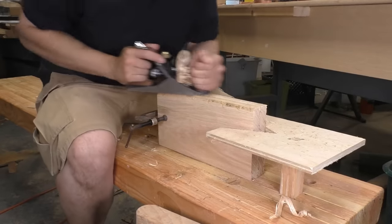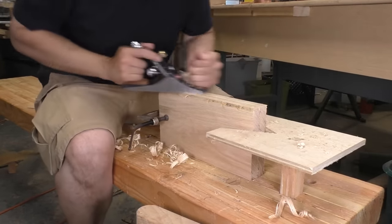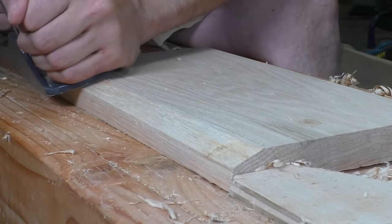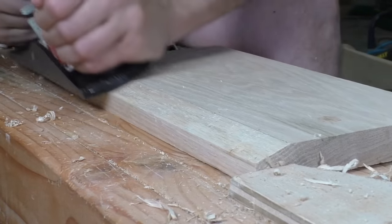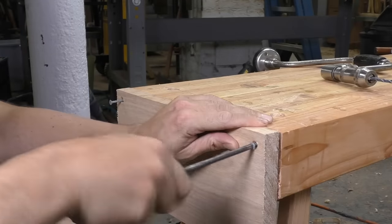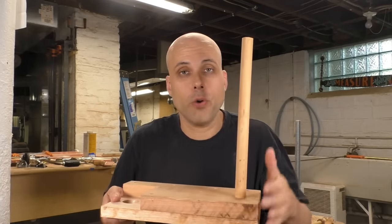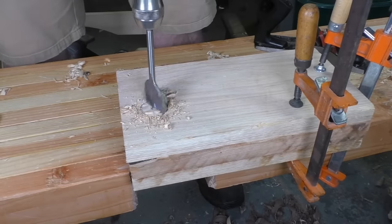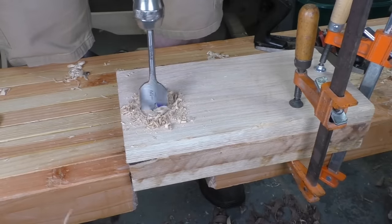After I've got all the boards cut, I'm going to clean them and square them up with my scrub plane. Once the boards are all clean, I have a rough corner on one of them, so I'm just going to use my scrub to turn that into a bevel — it's going to look nice, get rid of the rough wood, and also help the vise stay out of the way for operations like sawing. Now you're going to temporarily attach your inner jaw to the bench and scribe the location of the nut. Then take it back off and pick a location for your guide dowel — this can go pretty much anywhere, just make sure it's parallel to the screw hole and won't hit the legs of your vise. I suggest clamping all three boards together and boring both holes simultaneously to ensure perfect alignment.